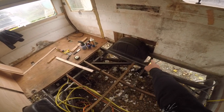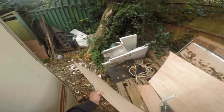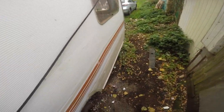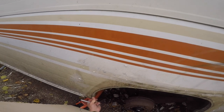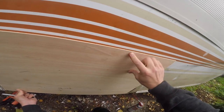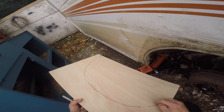What if I just take the wheel out and follow the inside of the curvature? Then you take a piece of scrap, make sure this is where it's supposed to be, put the scrap piece here, and on the inside just trace the curvature with a marker. Now obviously this is on the inside — the outside should be bigger. But I think this is the most accurate method really.